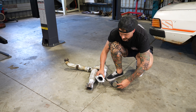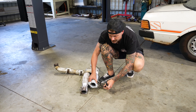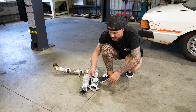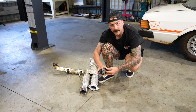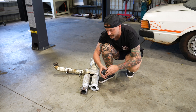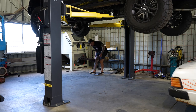He's replicated this flange for us here. It's got the tapered conical reducer adjoined to it, and so what we'll do is make this out of a one-piece machine part. We shouldn't have to worry about it warping from trying to weld a cone on or anything like that — it'll just be a really nicely finished product. The section of the exhaust that that mates into is this piece here.